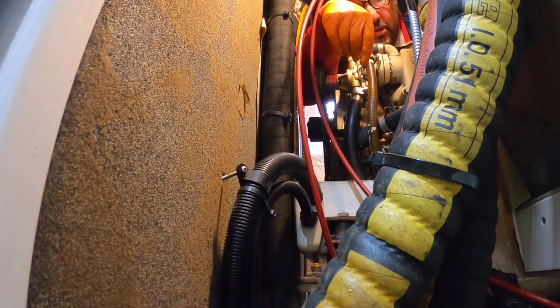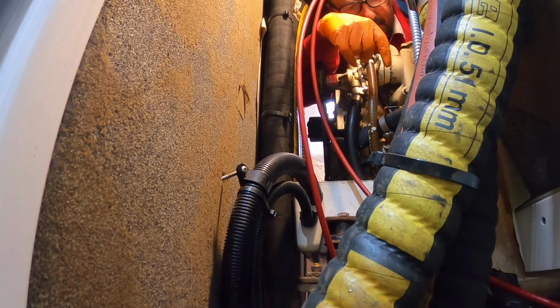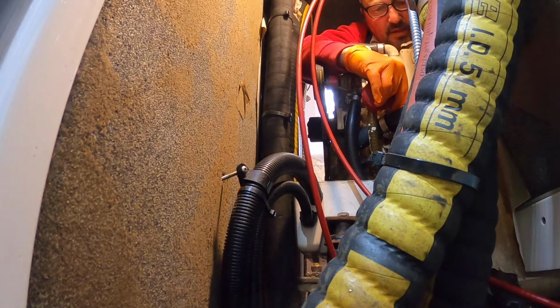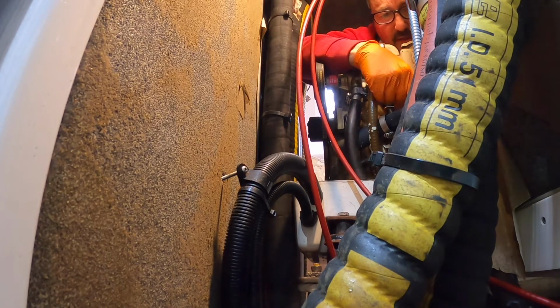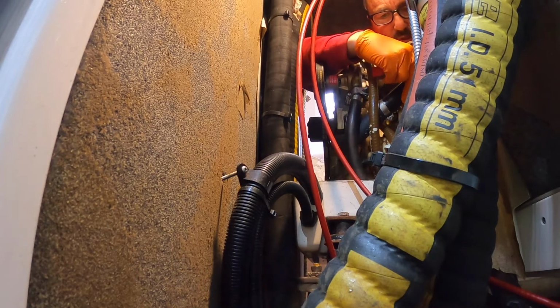I'm just going to, so there's a positive lead from the starter motor. Just going to wrap some red tape around that. Nothing worse than sparks around the place when you're trying to dismantle stuff. Isolator is taken out. There's a switch that can take this handle out. There's no way that can be switched on, and I've also disconnected the battery.